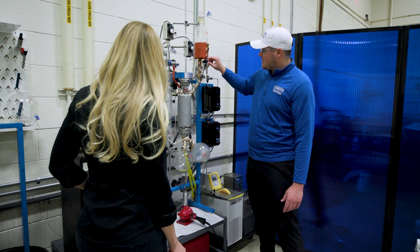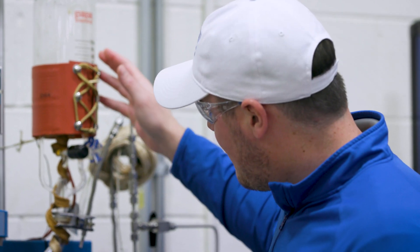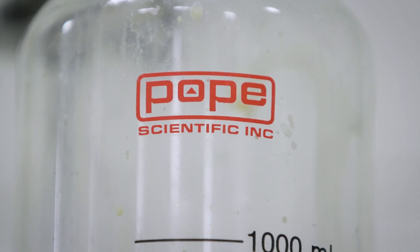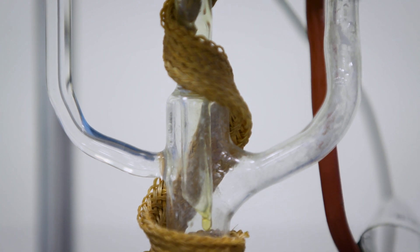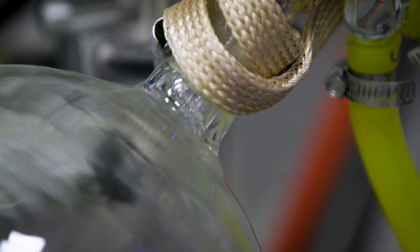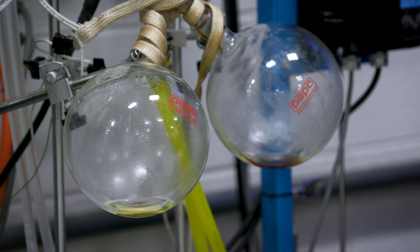You do a vacuum check on it just so you can get a feel for what's going to be coming into your lab and how to actually handle that. From there, I take you in front of a 2-inch system that I have here in-house and do a mock run using fatty acids. It gives a good parameter on what you're going to be running with your cannabis oil, whether it be CBD or THC. After processing the fatty acids, that gives you a good representation of the distillation of your cannabinoids, just with a different material. So you get to see the distillate, the residue, and how both of them equal out to being a good process.